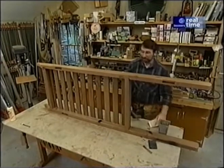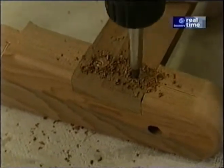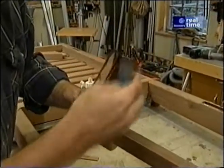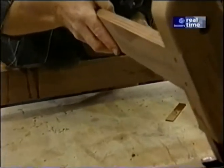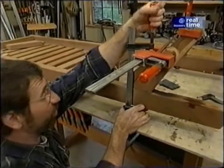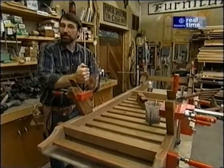Now this is the socket for the cross piece, and I'm going to switch to a much stronger glue — a polyurethane glue. I put a thin coat onto one side of the joint. It actually likes to cure in the presence of moisture, so on the end of the cross piece I'm simply going to wet it. These slats are so close together that it takes a little patience to get them engaged, and then you can start to set them. Now a couple clamps. I'm also turning to my polyurethane glue to hold these legs in place — glue in the socket and wet the tenon. We'll clamp this in place because that polyurethane glue actually expands quite a bit as it cures. We'll let this set overnight and tomorrow we'll easily finish this project.